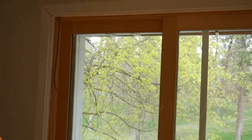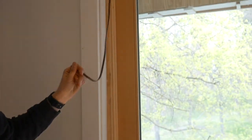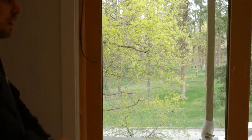Here's an example in the master bedroom. We have this gigantic door, and here is just a really simple 16 gauge wire that we ran into the walls, all into a central location. We pop it up right above the jamb, and we're going to have four different shades here — a blackout option with honeycomb shades that go up and down, all synchronized so they act as one unit. From a style standpoint you might still want curtains off to the side, but you'll doubtfully want to close them every single night, so curtains become more of a decorative feature while the shades are the functional feature that disappear during the day and give you that great view. We want people in a hundred years to look back on how we wired this home and say it still made sense.